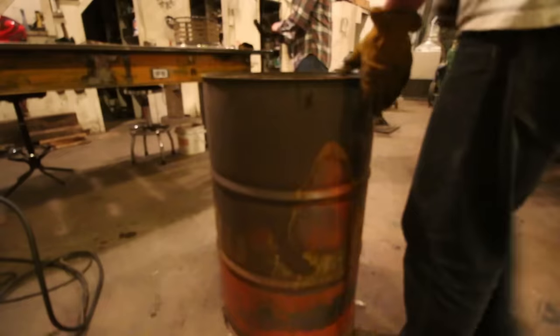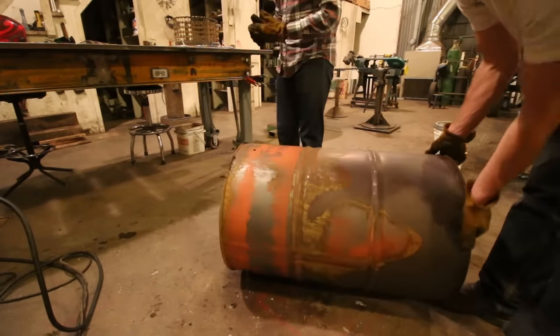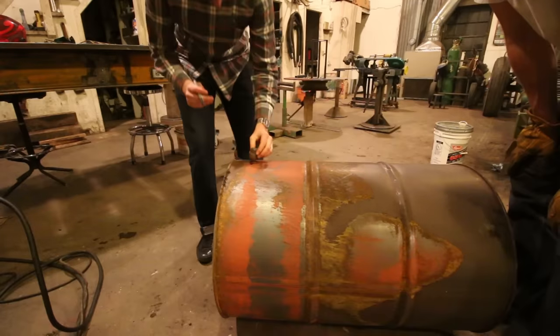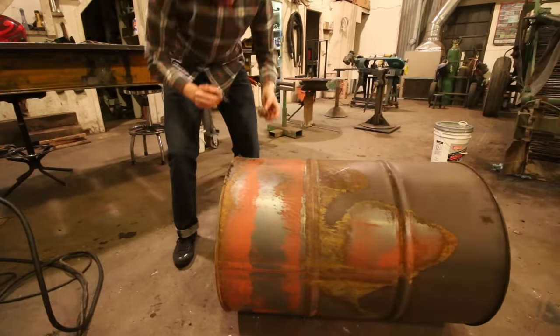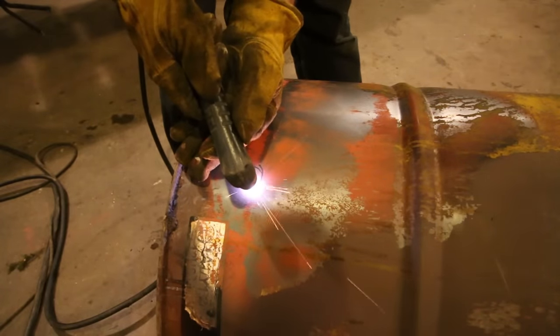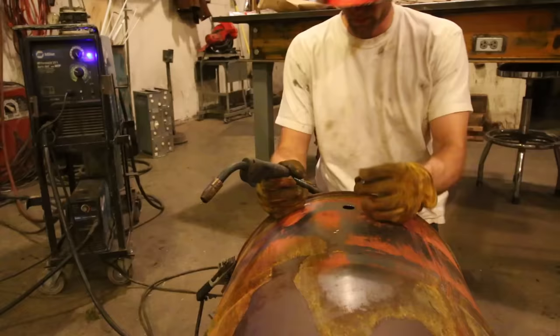And to control the size and heat of the fire, we needed to weld a valve at the bottom of the barrel over the air inlet. Put your nipple in that hole right there. So this is the big one. We welded a 1 3/4 inch nipple on that the valve will go on, and then a couple more half inch nipples on the backside, just in case that wasn't enough airflow. Just planning on capping them for now.